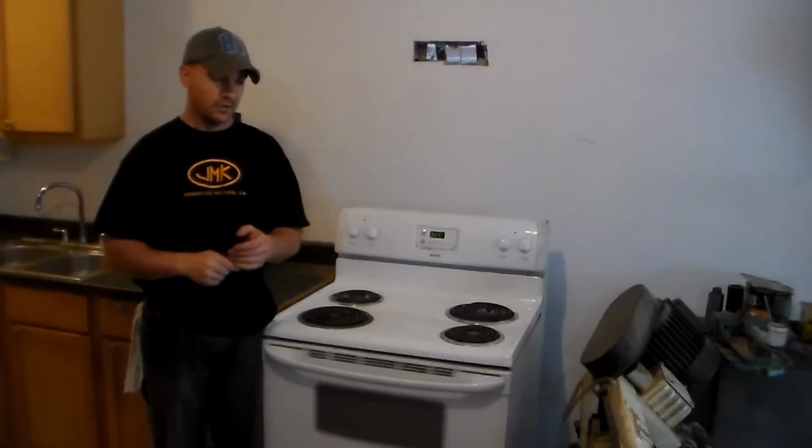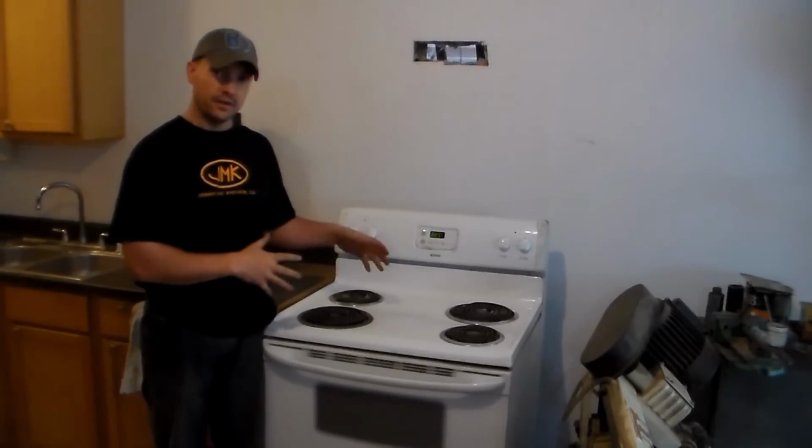I have had a lot of people ask me, well, why don't you use that fancy knife maker's kiln that you have for the tempering? And it has a pretty broad swing in temperature control on the low end. If we're up in the higher end, up above 1,000 degrees, it has a pretty accurate ability to hold temp. But when you get down to what we're doing here, around 400 degrees, it tends to swing up above and below that temperature, which we definitely don't want.